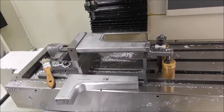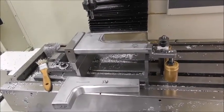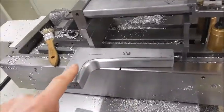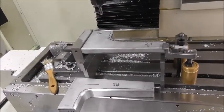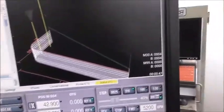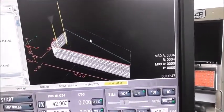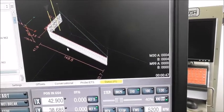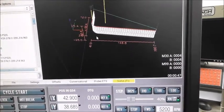So you've got to think of ways to double-check absolutely everything so that the first part is perfect. I'm matching into an existing contour and cutting an extension curve out, matching angles and radii, and it would be very easy to get this wrong. There are several things you can do to check. One thing is to have a careful look — simulate in the CAD/CAM — but even when you're on the controller, have a careful look for any strange lines showing the cutter going into the work. Those are well worth heeding as warning signs.